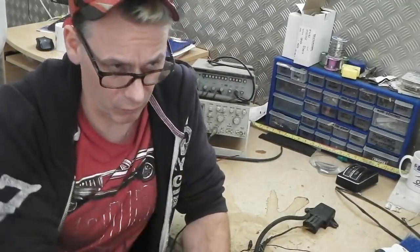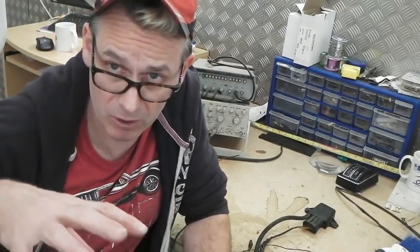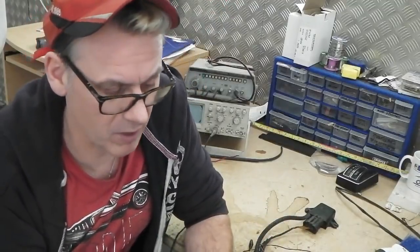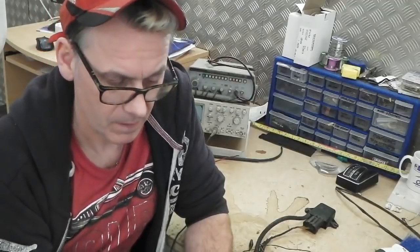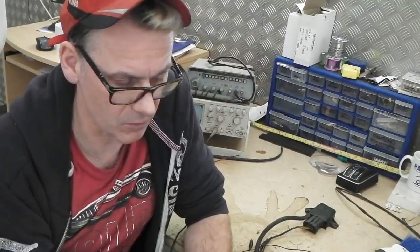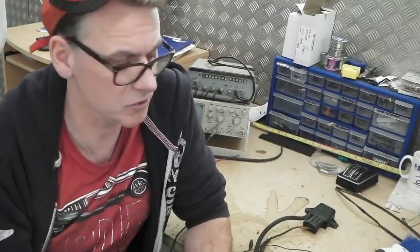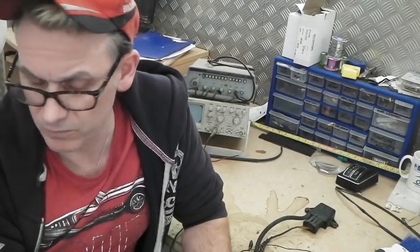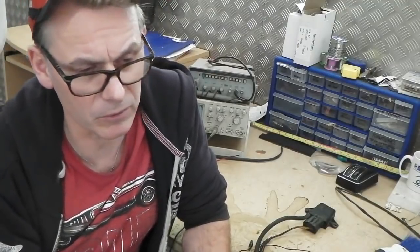We've got the suspension front cradle to finish off, a few little tweaks to do to that. Gearbox is done, of course. Dashboard needs now tying up all them harnesses, and then we work our way into the engine bay harness. But there are no modules in there. It's simply a case of wire wrapping and neatening up, and there's a couple of additional cables that need to go in. But other than that, that harness doesn't require the hardcore electronics bench to be built. So that's probably my next job, engine bay loom, but to be starting to think ahead.